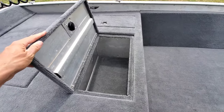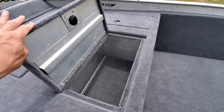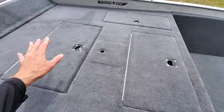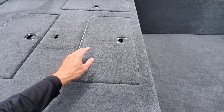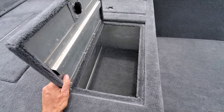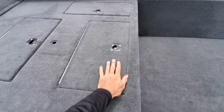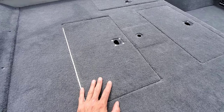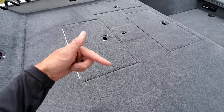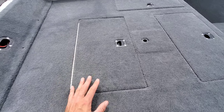I framed in a recess to give it a look to match the other two hatches. We went back with 090 sheet aluminum and all new angled framing, inch and a half by inch and a half, 1/16th, riveted everything together, and then I dropped in two of Nate's Custom Boats and Accessories dry hatches. I retained the factory hatch but moved it back a couple of inches. These dry hatches are from tinyboatnation.net — I'll leave the link in the description. If you're doing a project yourself, I strongly recommend using these, especially if you're going aluminum.